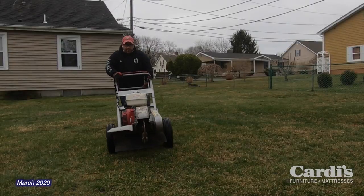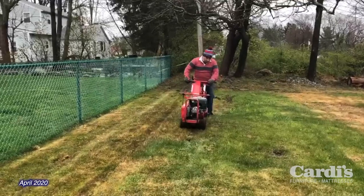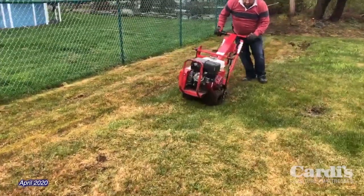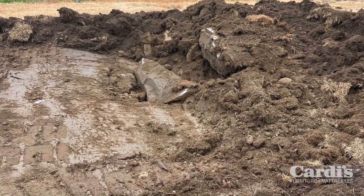In March of 2020 I rented a stump grinder and ground out the stumps in the back and side yard. Then in April the really fun stuff started. I rented a sod cutter and sod cut the entire grass about an inch and a half to two inches deep because I wanted to get all those weeds and weird stuff out — I wanted it gone. Then we got a jackhammer and jackhammered down these massive boulders where the tops were near the surface, getting them to about 10 inches below the top layer. That was a backbreaker.